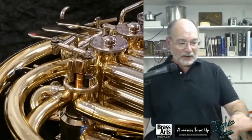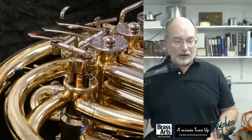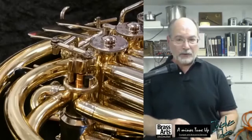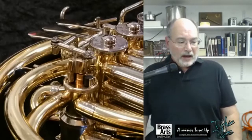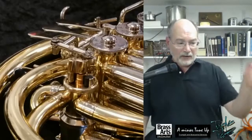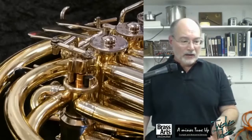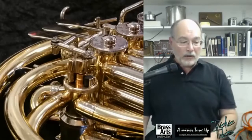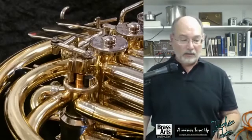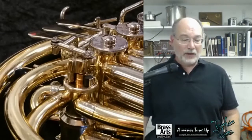It's beautiful. There's a retaining ring on the top, or what we would actually consider the bottom, because what you're looking at with the stop armature is technically the bottom of the valve. And on the other side is the bottom of the valve, and the top is hidden. The two tops are next to each other. They bear next to each other. And getting that, how do you get that out? Well, you have to take the bits off and take the retaining ring off. Well, how do you get the rotor out? Because normally, you drive the rotor from the bottom out through the top. But you don't have that luxury. You can't drive it through the other rotor. And you can't drive the one underneath through the other rotor. It's not going to be physically possible. So how do you get it out?